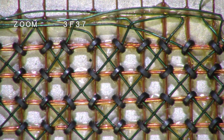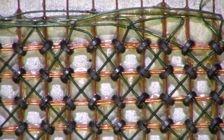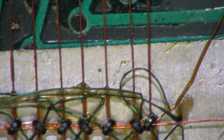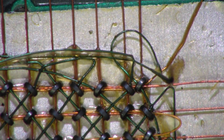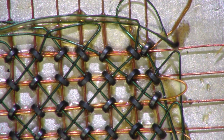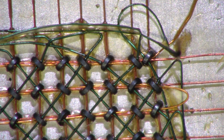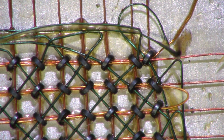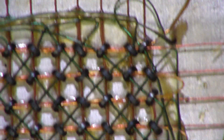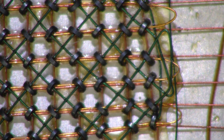Look at that — that's as close as I can get. You can see there are four wires traveling through each one. These are all enamel coated wires, and the green one there is going to be the sense wire. You see how they all loop through and wind around — it's quite an effort to get these through because they are absolutely tiny. The green one is your sense wire, then you've got your X and your Y wire running through, and the fourth one is your inhibit line. That is a nice little close-up of some magnetic core memory.